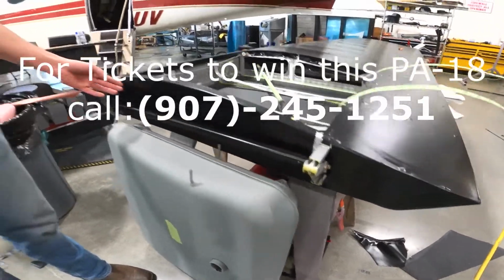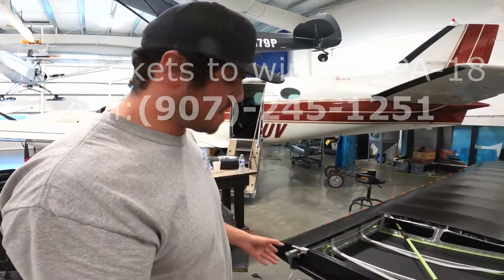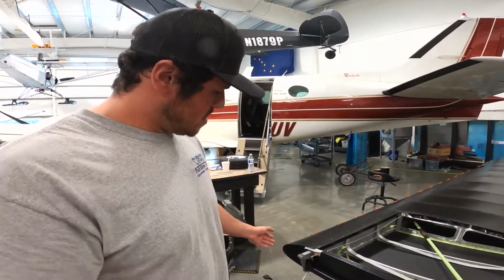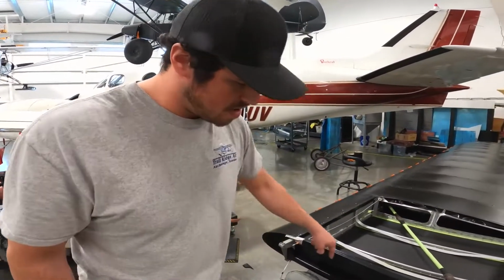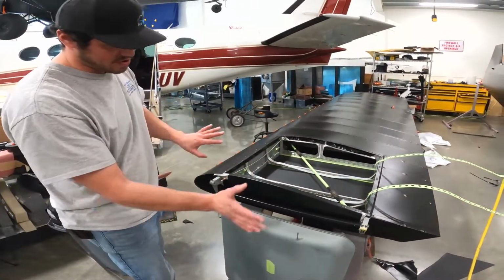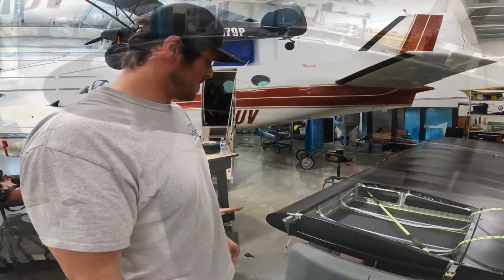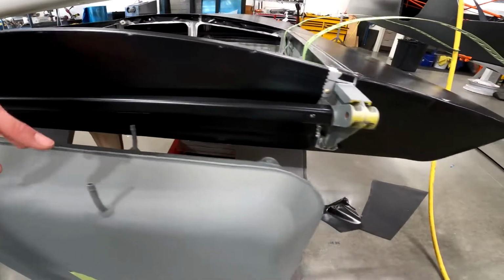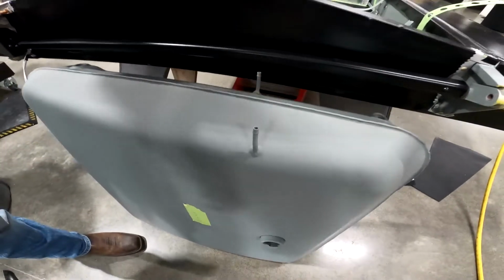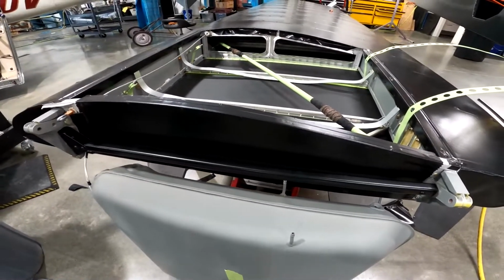So you can do it with the fabric you lay on the wing and get it over, but with this stuff being so easy just to stick pieces on, I just glued around on the end of the rib and cut individual pieces just to cover it up, glued it on, shrunk it up, and it turned out real good. And then too, where the sight gauge comes through and where your two fuel ports come through, you know, burn little holes there, and it'll be looking real clean.